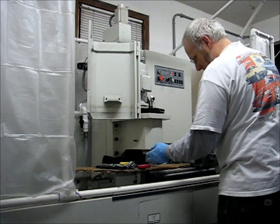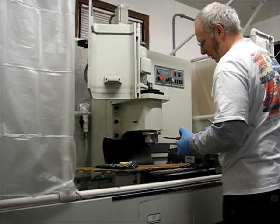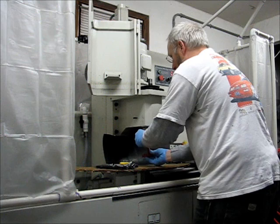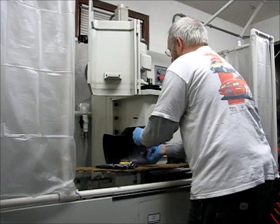All right. Raise the head up. I see the pulley is actually holding the spindle cartridge in place. Not convinced that's a great idea right now, but this will give me an opportunity to get the bolt snugged up a little bit so that it's holding the weight rather than this pulley, because the pulley is going to put a moment on the shaft. So there we go. I have the bolt lifting the cartridge now, and then I'll start another bolt.